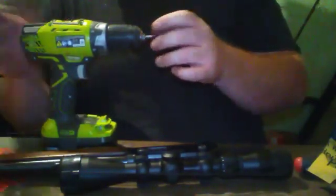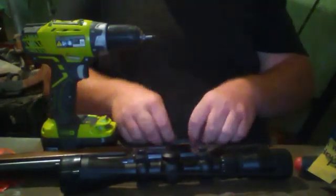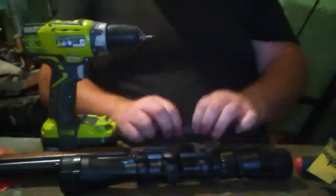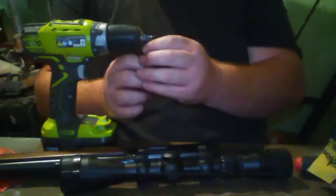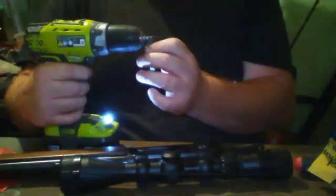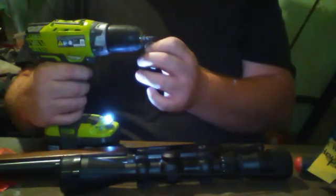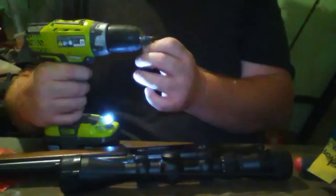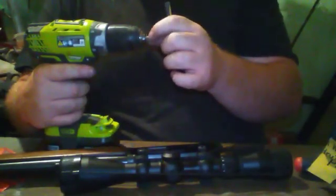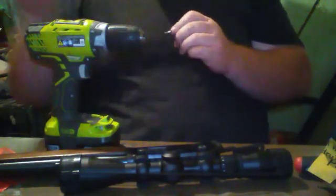Let me feel it. We're going to go to 1500. Same thing. Little strip. Fold it over. Fold it over again. So I make this little strip like this. Bring that on up. Pinch with your fingers here, but not tight. Pull down slightly. Just move it back and forth. Real short little movement. That's good. Okay. All right, take it off our tape. And there's our polished screw.